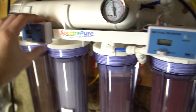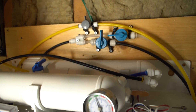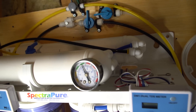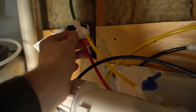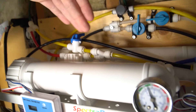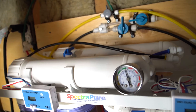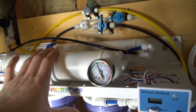When I first turn this on, the key to saving your DI is having multiple flush valves. There are two different types. The first one flushes your membrane — it's very easy to make a DIY flush kit. I have a Y that goes off the waste line, so it basically bypasses the restrictor and lets the water rush through, getting any extra TDS out of the membrane.